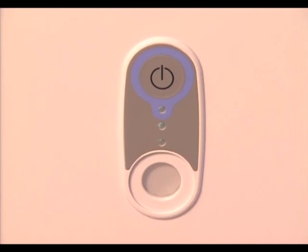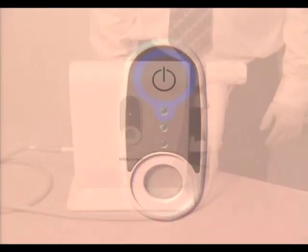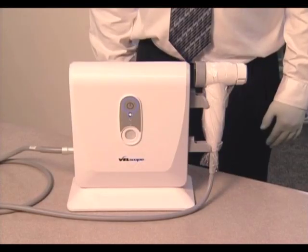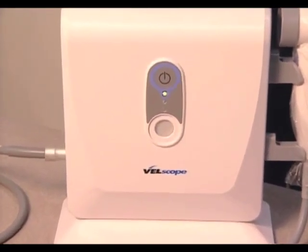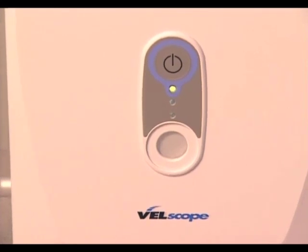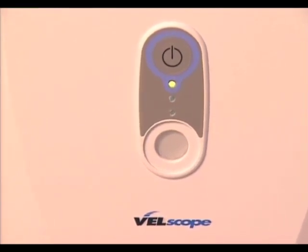The LSU will remain in this state for another approximately 90 seconds. Up to this point, the power button is disabled to prevent premature shutdown of the lamp, which may damage it and shorten its lifetime. After this period, the lamp status LED indicator will turn solid green, meaning that the unit has fully warmed up. You now have complete control to power down the unit when desired.